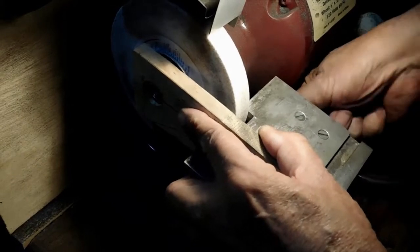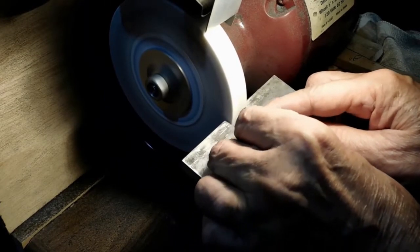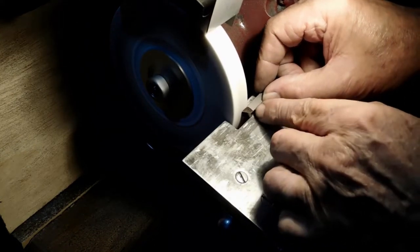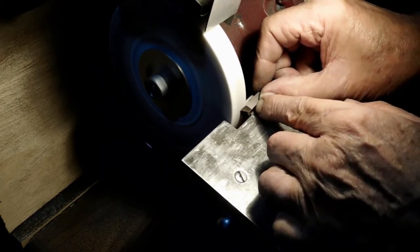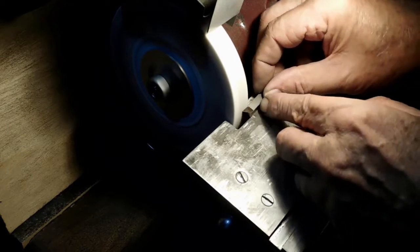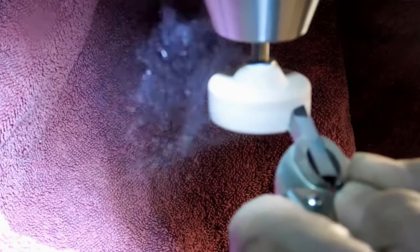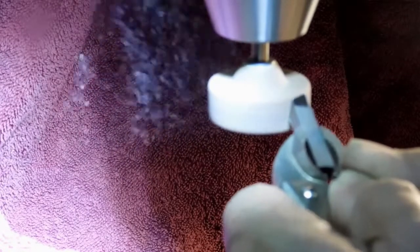I'm using a jig here to put my table at eight degrees, which is the relief that I want on this cutter. The front angle — I've almost got it all done, so just a few cuts here. Now we're doing that side — that three-degree relief on the side. We still don't have the curve on the front yet. I've got this spinning in my mill and I'm trying to hold it at the eight-degree relief and get that curve diameter worked out.